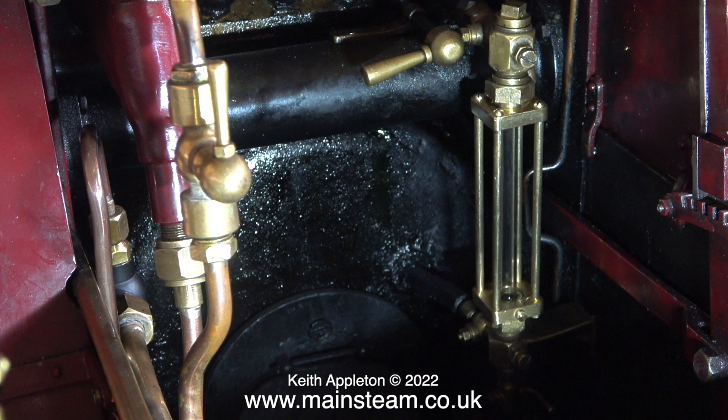The good thing about this design is not only do the four bars protect the gauge glass from being broken, they make the entire water gauge much more rigid. Because unlike a railway locomotive, traction engine water gauges are not normally fitted directly to the backhead - they usually have extension pipes. So this makes the whole arrangement much more rigid and therefore less prone to breaking. That is it - a bit of useful information about making a different type of water gauge protector that not only protects the glass tube, it protects the gauge frame and keeps it more rigid.